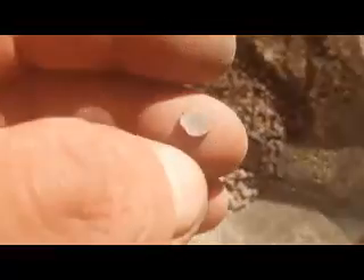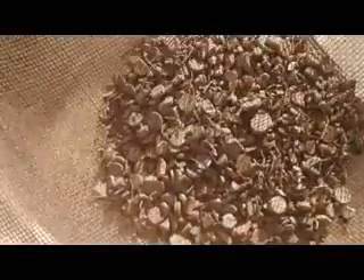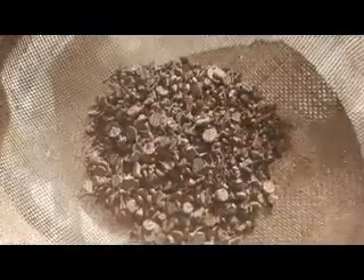I'm guessing — since I haven't done these before — that the circular discs are where the silver is, and most of this chunky stuff should be silver. Anything remaining is probably the steel legs and powdered ceramic. I'll do a gravity separation anyway in case there's silver in there — maybe joined to the legs — and we'll keep all the heavy stuff, wash away all the ceramic, and treat it along with this. I'll put it in the dolly pot again to see if I can break it up more.